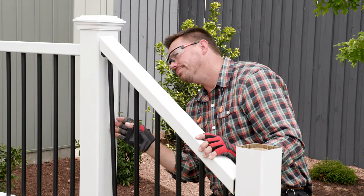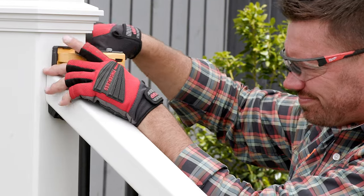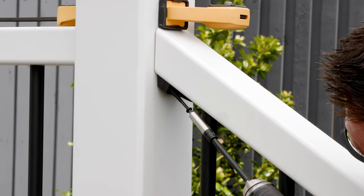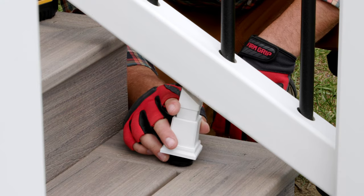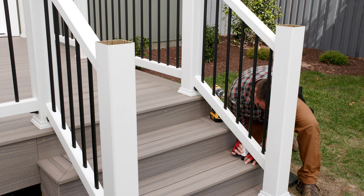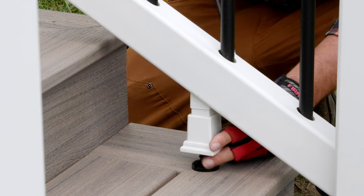Once all the balusters are in, make sure the top rail is all the way seated and everything is snug. Just as we did with the bottom rail, place clamps under and above the rails. Next, center the top rail on the post sleeve. Again, using the driver extension, pre-drill for the provided 3-inch wood screws. Go slow when installing the wood screws and be careful not to over-tighten. I positioned the foot block so that the nub was engaged with the hole I previously drilled in the rail. Next, I twisted the turn mount until it was fully tightened in between the deck surface and the rail. With the mounting hole facing outward, I installed one number 8 wood screw which was provided, and pulled the sleeve down to cover the turn mount and screw.